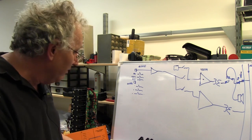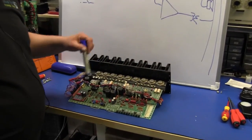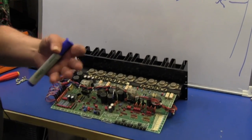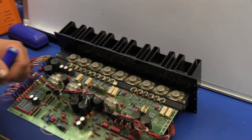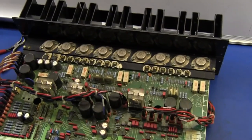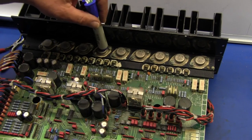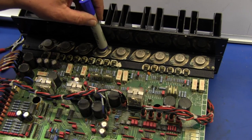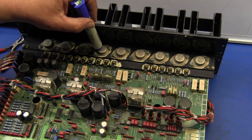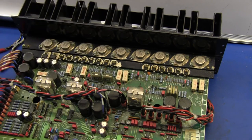Tell us about them. Well, things like we've got probably 3 times as many output transistors as are actually needed. Mm-hmm. They're just in parallel? Yep. This is where we probably want to go to the circuit diagram, but for example, the 150-watt amplifier has 3 pairs of these beasties. Now, ordinarily out of 3 pairs of those, you would probably get a 300 or 400-watt RMS rock and roll amplifier. Yep. Okay. Which you've designed many of.